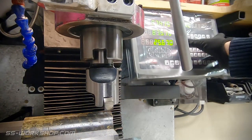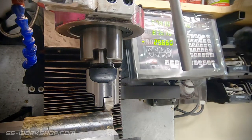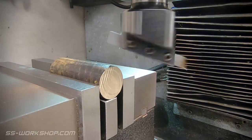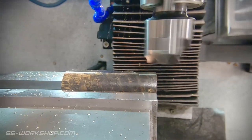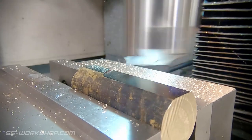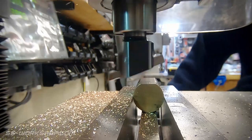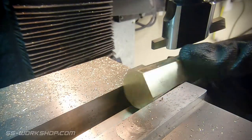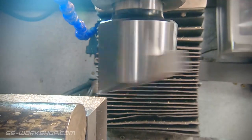For this I'm going to use my fly cutter. It did a great job the last time I used it so I thought I'd give it another go. I've measured the diameter of the stock and set that in with the tool set on top of the work. With that said it's time to make a cut. Once one side's machined it's time to turn it over and machine the remaining three sides. Once that's done the part will be the size on four sides.